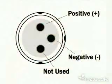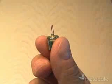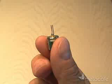You're almost done. All DVD laser diodes use a similar configuration. Be sure to test your polarity using two AA batteries. Then you're going to solder two longer pins onto the positive and negative terminals of the laser diode. Disassemble your mag light,